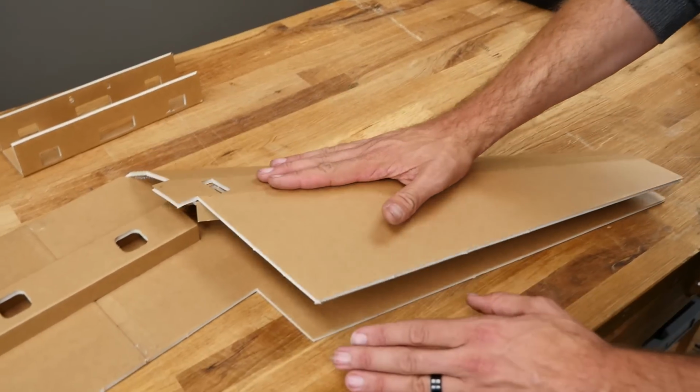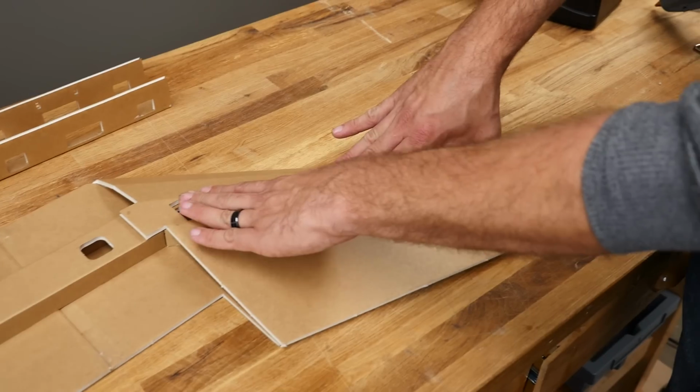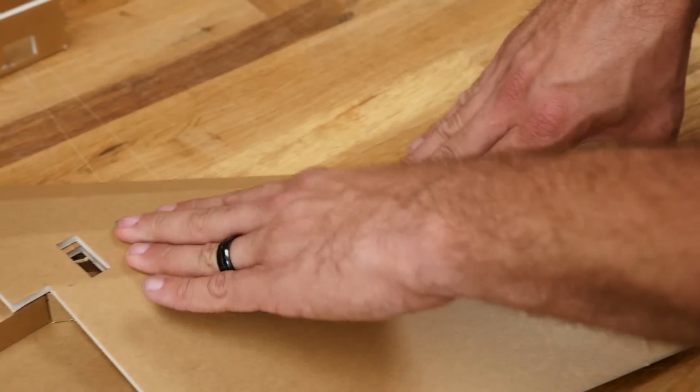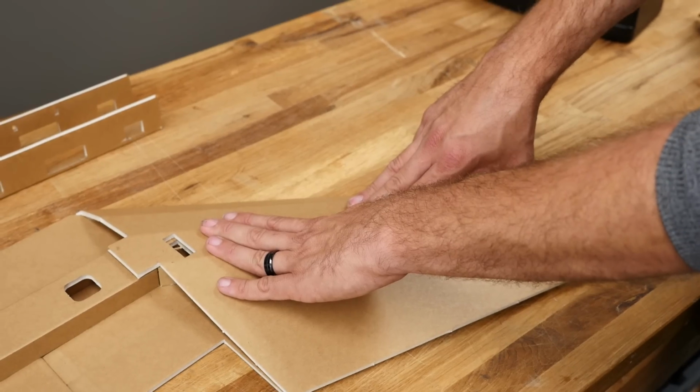With this flat against the table, all of our attention's now gonna go right over the spar. Don't worry about what this trail edge does because there's no glue. Just hold down over the spar. Give this about a minute and a half of drying time.